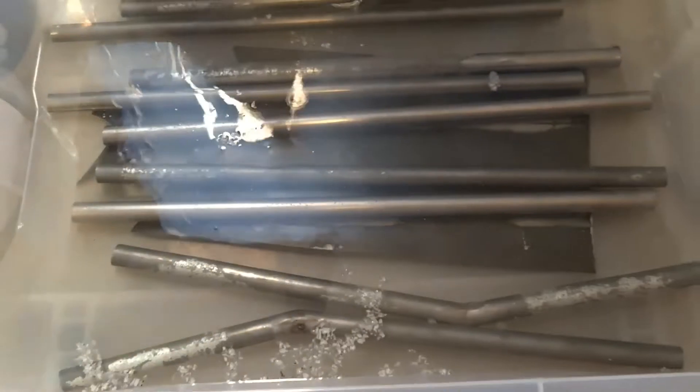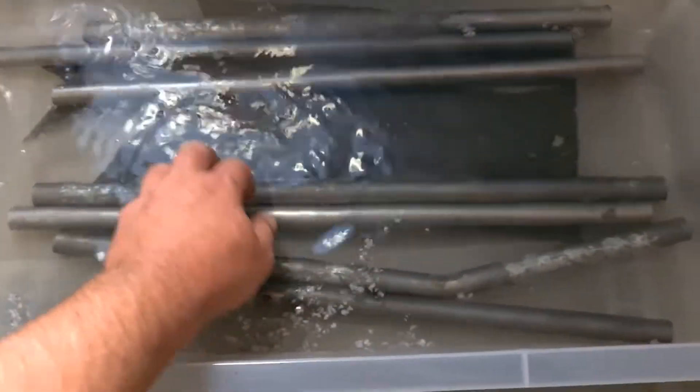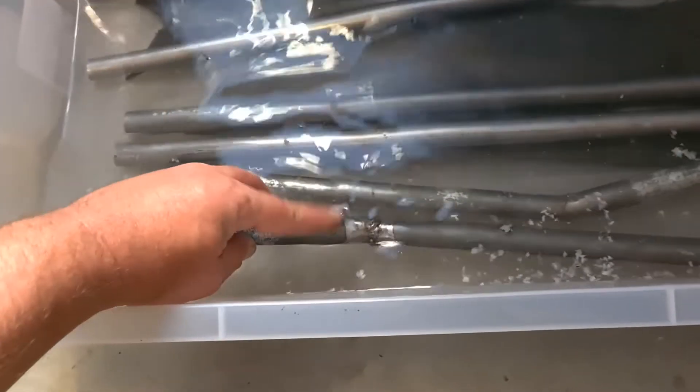which is acetic acid. This has been soaking about 10 hours, so it does take a while — but there's no galvanizing left on that pipe. You can see this one still has a little bit here, and it's been removed over here.